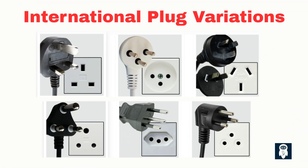There are currently 15 types of domestic electrical outlet plugs in use worldwide. Different countries use different plugs, but the safety principle remains the same. Whether it's the British BS-1363, Indian IS-1293, or Australian AS-NZS-3112, the earth pin is always bigger and longer. Even in two-pin systems, grounding is sometimes done through the outer casing of the socket.